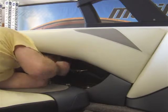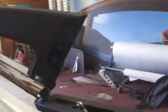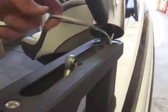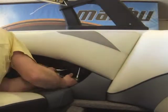You are going to find the white and black anchor light wire and cut it underneath the gunnel. This gives you enough room to then go back and butt splice it later. Pull the anchor light up through the base plate and out.